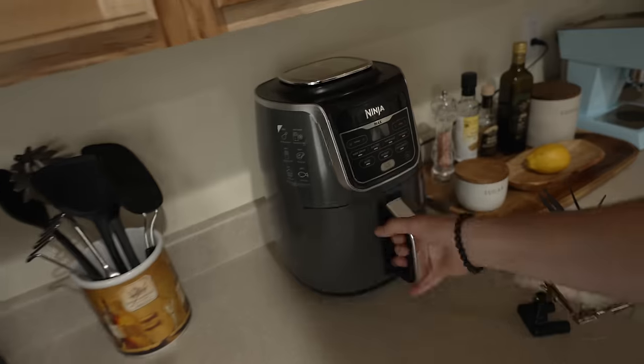One of the disadvantages of printing these things standing up versus laying flat is your layer lines are not as strong that way. When you print with your layer lines stacked on top of each other, they can actually separate, and there's a lot of force when those props spin up. If we try to print them laying flat, we need too many supports and it gets messy. So what we're going to do is use a process called annealing, where we actually try to melt the layers together a little bit and help them be more durable. And this is our annealer — the Ninja Air Fryer.